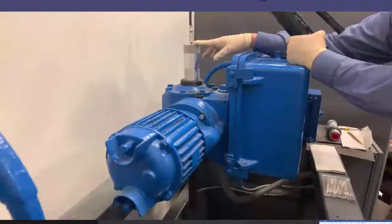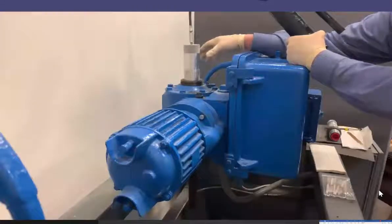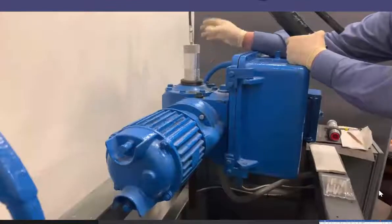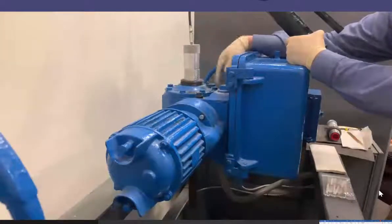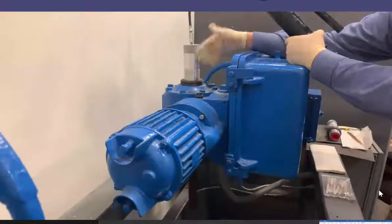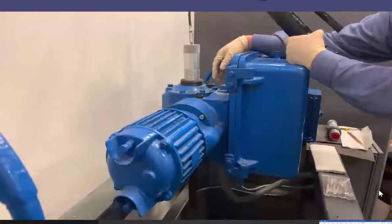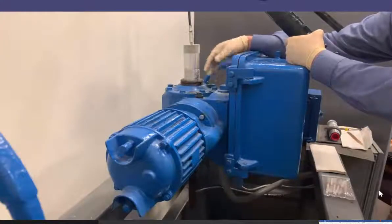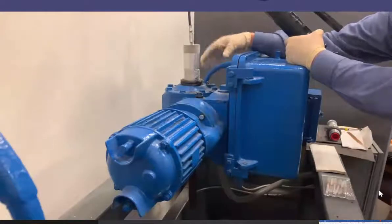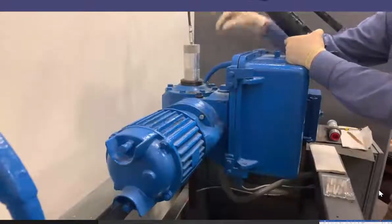This is not an in-service running application — when this tool is on, you would not want the stem to receive a signal to go up and down. You would have to put the valve in position and keep it there with a lockout/tagout. However, it's not necessary to remove the valve or actuator; we can do it while it's in place. Talking to folks who have used this — like Domingo and his colleagues — they mentioned last year the safety aspects: you don't have to rig it out of the way to access the nut and lubricate.